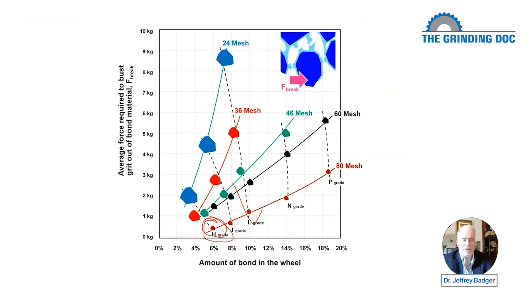No. Unless you're grinding some extremely difficult to grind high-speed steel or a nickel alloy and you're obsessed with burn, there's just no reason to go with an H grade wheel. And this was a standard, easy to grind steel. So I said, nope, let's not do that. Let's go harder because this is a cylindrical OD operation. It has a short arc length that's going to get bigger forces on the grits. So we need to go for a harder grade wheel.